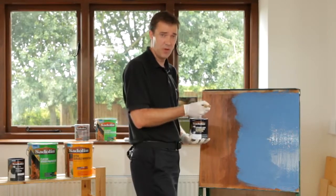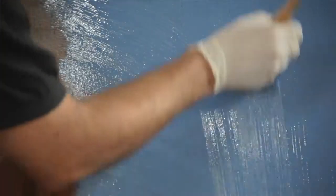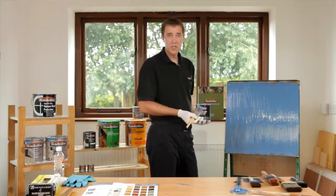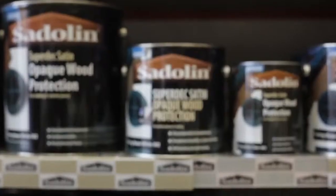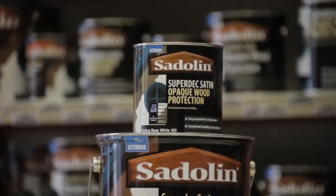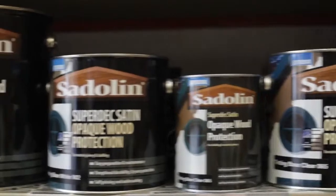With this system, after about an hour it will be touch dry. However, we recommend leaving a 16-hour drying time because of the nature of the alkyd-acrylic formulation — that will promote best performance. Ultimately, we're looking for up to eight years of protection. Once dry the following day it's ready for a second coat, and then the job is done. For maintenance, all you need to do is give the surface a wash down and reapply one coat. Sadolin Superdeck is our key opaque system, offering a massive colour range to meet your requirements or your clients' requirements.